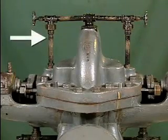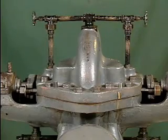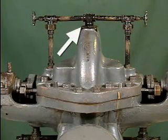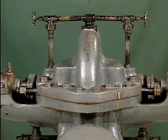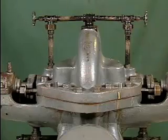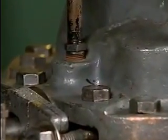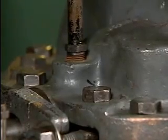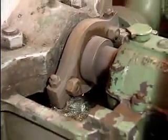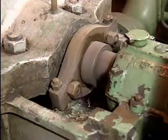The gland sealing line provides a means to deliver water to the stuffing box. If the pump is moving water, the water can be delivered from a point on the upper casing where water is discharged from the impeller. In some applications, the water is delivered from an external source. The water serves as lubricating fluid for the stuffing box to minimize friction between the packing material in the stuffing box and the shaft as the shaft rotates. This water from the gland sealing line ultimately leaks out of the stuffing box along with the controlled leakage from between the shaft and the casing.